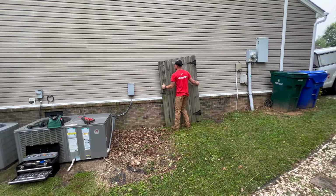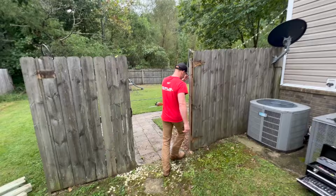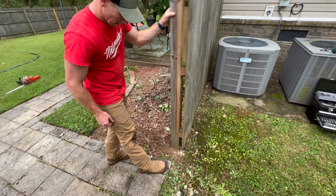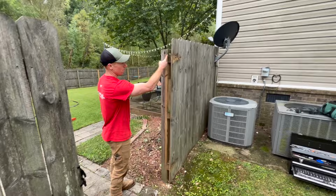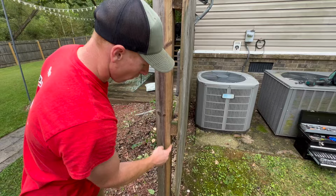Carefully against the siding. So let's go and take a look at this fence post. Man, that thing is shot. I don't want to rock it too hard because if there's anything good left on there, I'd like to use it to help us pull the concrete base out, if there's any concrete down there at all. So we're gonna go ahead and run our Sawzall right down this crack to cut the nails out of the 2x4 nailers. I'm gonna do that now.